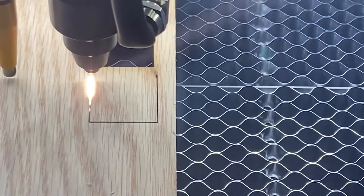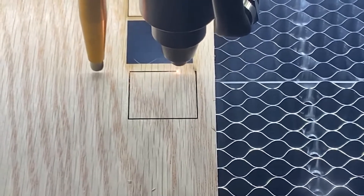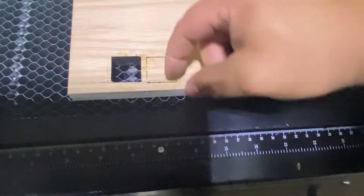The other thing: you need to make sure the max power on the machine — there's a button for it — don't set it to anything higher than 65, because you want to watch the ammeter and make sure it never goes over 30 milliamps. So 100% in LightBurn only means 65% on the actual laser, and you want to keep it that way to stay consistent. If you go over 30 milliamps, the life of the tube is going to go drastically down.